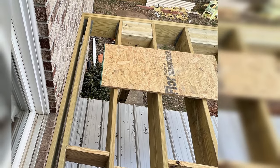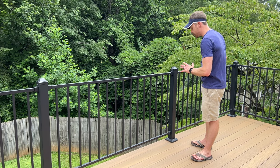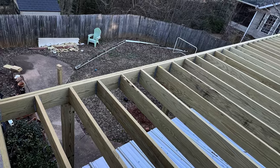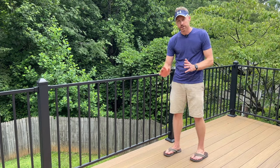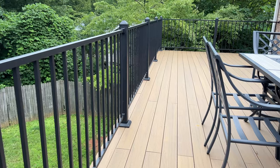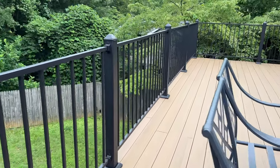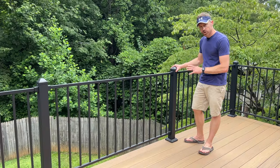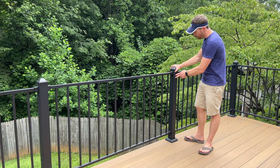As you're planning out your deck before you get your decking on, you need to measure out your post locations. I had to measure six feet, start at one corner, build that support, then six feet later do another support, and so on — all the way down. Make sure you have all of that support done before you put your composite decking on. You can then use shims to level everything up, make sure it's nice and tight, and then bolt your posts on.